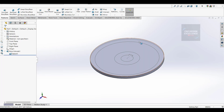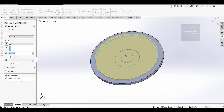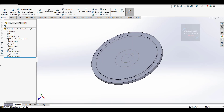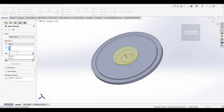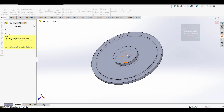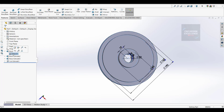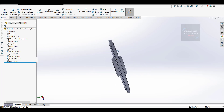We have to extrude the rest of three circles. Go to extrude again and select the second circle - this is 12mm, mid plane, click OK. Now the middle one - go to extrude again, and we have to cut the keyway and the shaft diameter in our sprocket. Go to extrude cut, select the sketch, mid plane, click OK. Now go to sketch again and hide - our middle portion with the keyway is complete.